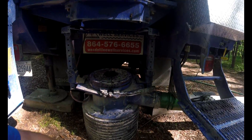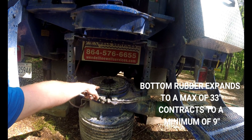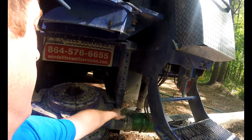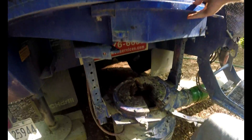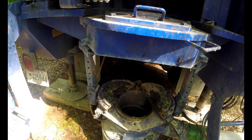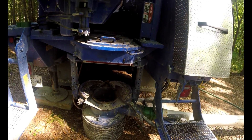We've got the diverter wrapped all the way up under the machine so we can get the rock cuttings away from it. These rubbers are dependent on your rod size — our rods are four inch, they make them for four-and-a-half inch and three-and-a-half inch as well. This opening size here is a 12-inch opening, so anything bigger than 12 inch and you've got to go to a different option.